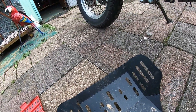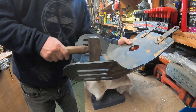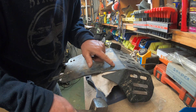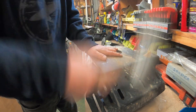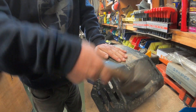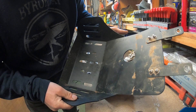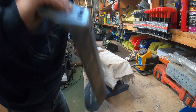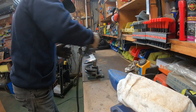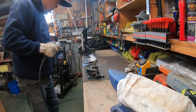I think I'll get it on the anvil and bash it straight, then see what happens. It's not really hard to bend — pretty soft actually. It's had a really big hit here as well. I've got it kind of a bit more into place. I'm going to grind it down and have a go at welding it. I'll have a little practice run on some scrap aluminium first. All right, seems to be working.